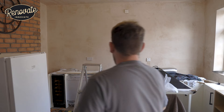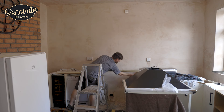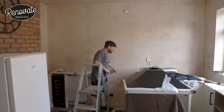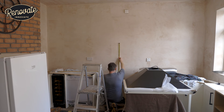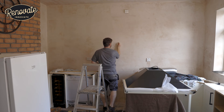I'm just marking up. That's the datum line we've got at the top of these units. There's going to be a little bit of 3mm ply underneath and then 20mm granite, and then we're going to give 750 to 800mm splash back in there. So we'll just measure up from that. We'll go our 750, plus 30, so 780mm from there — and that's where we want the bottom of our cooker hood to be.